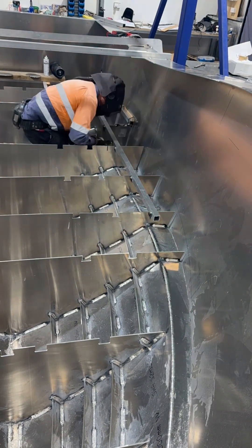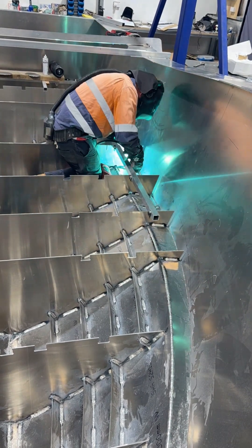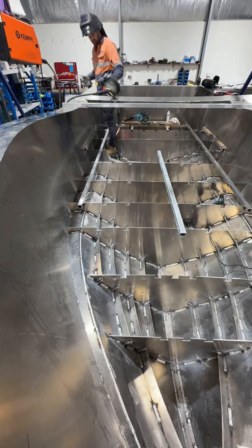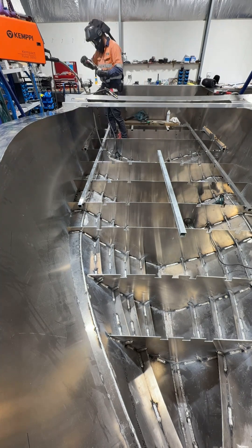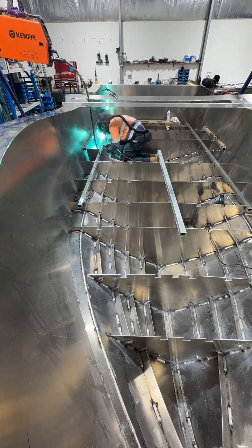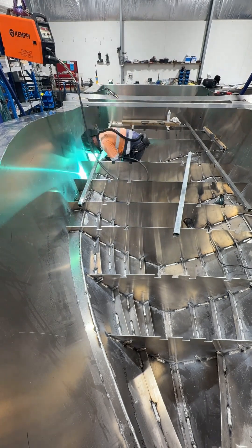These two heel fillet welds — they didn't take that long and weren't hard to access. I blew through a bit in a couple of spots, but all in all it didn't take that long. Once I had the welder dialed in I trimmed it as I was going, because that joint configuration changes the more forward you get.